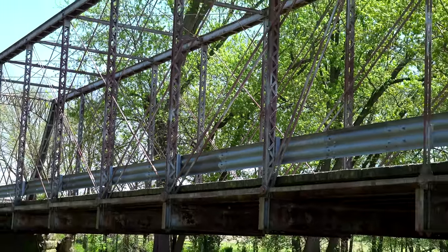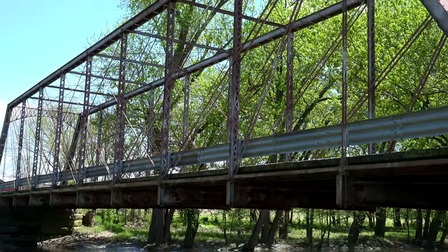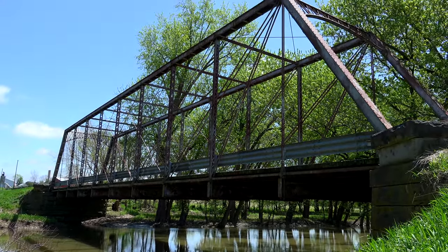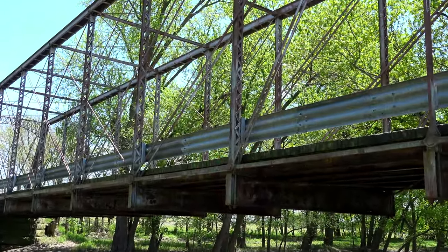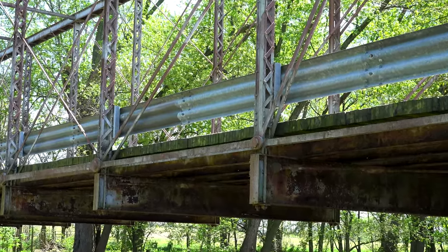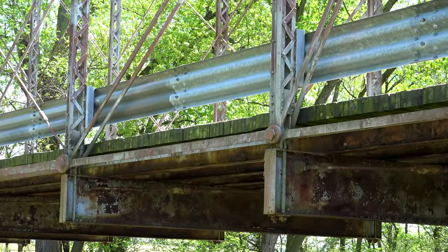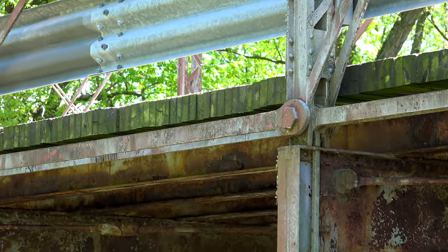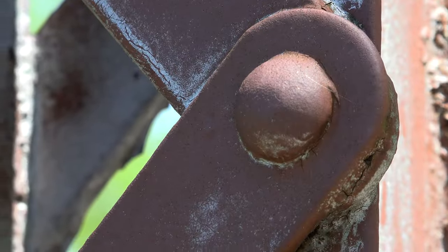For all the excitement that's given for historic covered bridges, it's really this kind of bridge — a pin-connected bridge — that American engineers were known for in the 19th century. The bridge is literally held together by pins: iron pins with threads on the end and nuts that hold them in place. And that's in contrast to the rivets that were used in Europe.